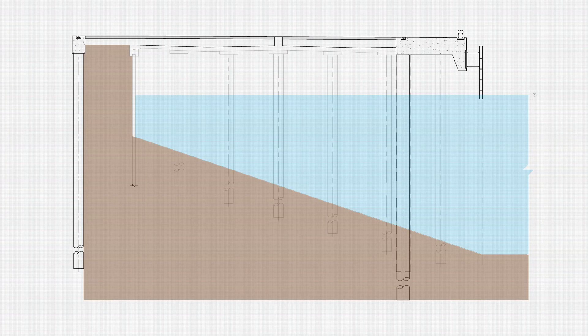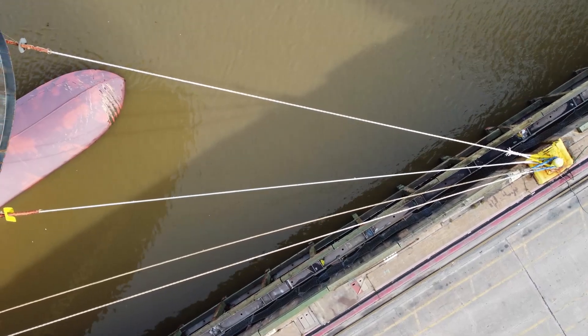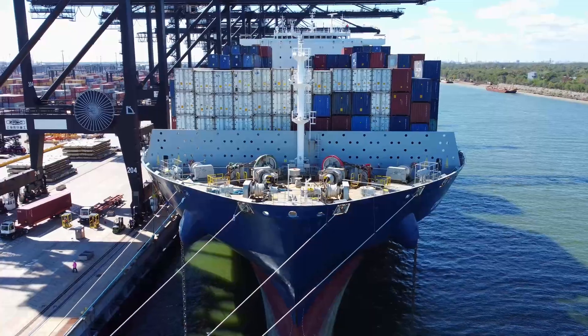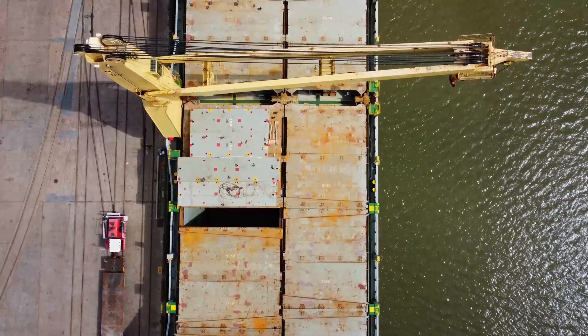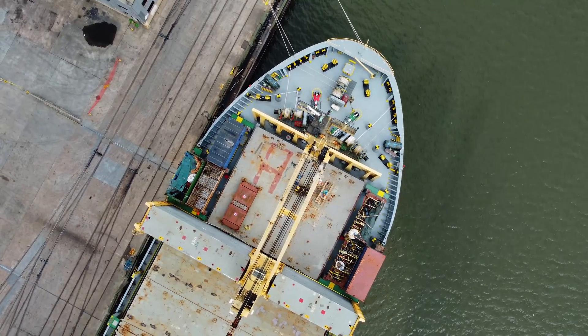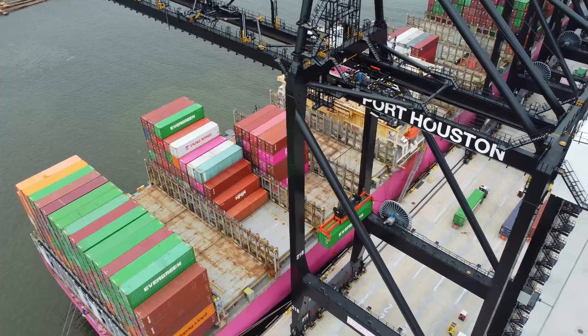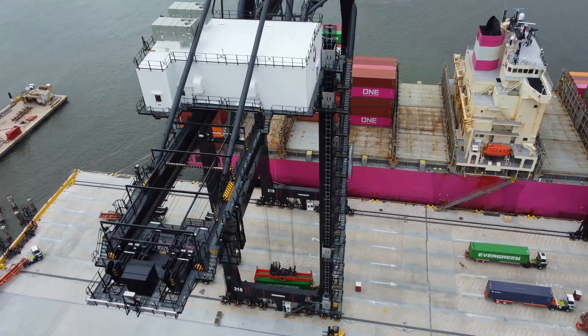On the edge of the wharf, we have two components that relate to the ship – bollards and the fender system. Bollards are used to secure the ship's mooring lines, which are ropes that keep the ship secured while docked. The fender system is a structure or device that protects the wharf face from the ship. When a ship is docked, it is not fixed and will slightly move with waves and cargo transfer. The fender absorbs such movement energy and protects both the wharf structure and the ship from damage. Other components may include a support building for stevedores, a rail system for cranes, a rail system for railroad cars, and utilities needed for ships and safety.